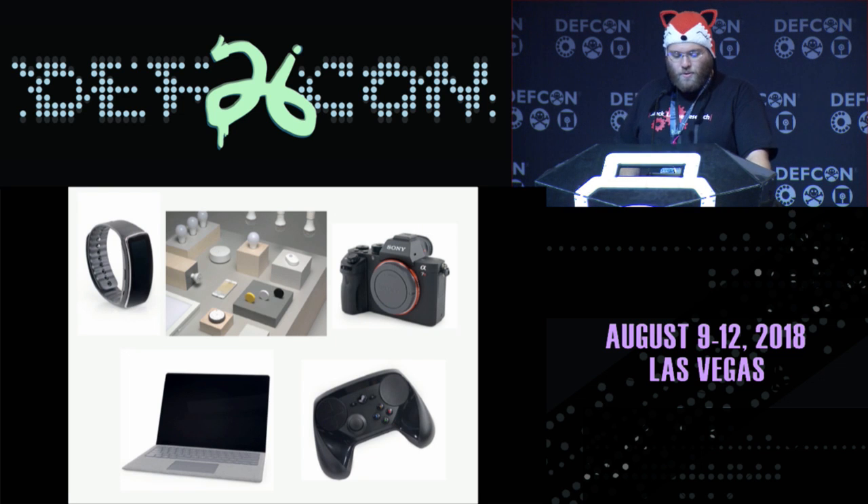There are ARM devices all around you, including in routers, cell phones, and NAS devices. QNAP has a version of their NAS that runs on a Cortex ARM system. Synology produces hundreds of devices running ARM chips, and even new laptops with Qualcomm Snapdragon chips are running Windows, Linux, everything. In the non-SOC world, ARM takes up everything — from smartwatches to home lighting to even your laptop today. In the Surface alone, there are four or five ARM chips just for firmware control, disk access, and even the touchpad has two independent ARM chips. The Steam controller is built around a Cortex M0, and IKEA's Trådfri lighting system is built around an embedded Zigbee and Cortex ARM0 base station.